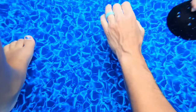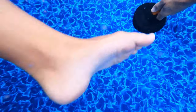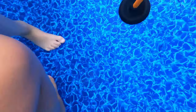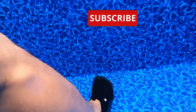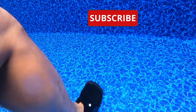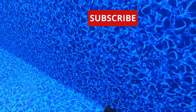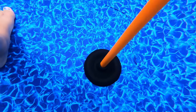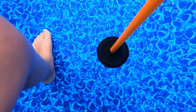Then use those rubber shoes and kind of kick the liner in the same area where you put the plunger. You're trying to slightly kick the liner back into the corner — or rather, close to the actual wrinkle itself — basically trying to stretch that liner back out. Keep alternating between the plunger and kicking, a little bit at a time. We don't want to get too aggressive here.